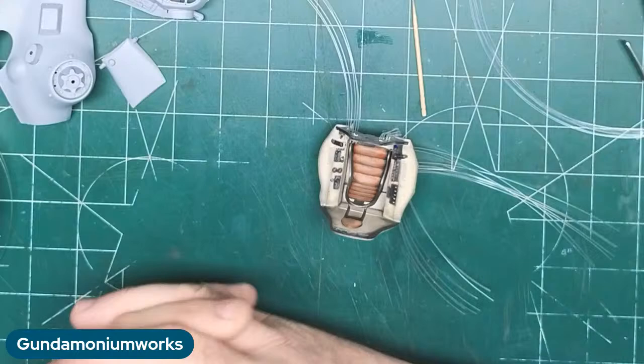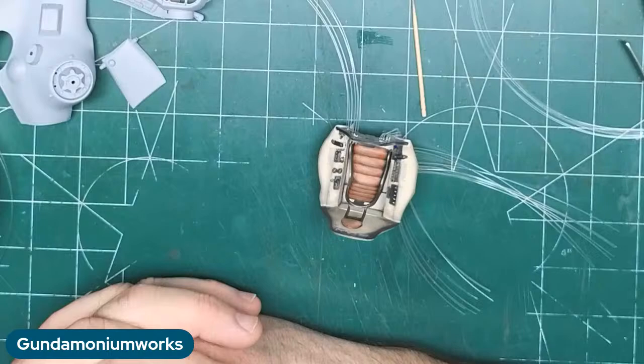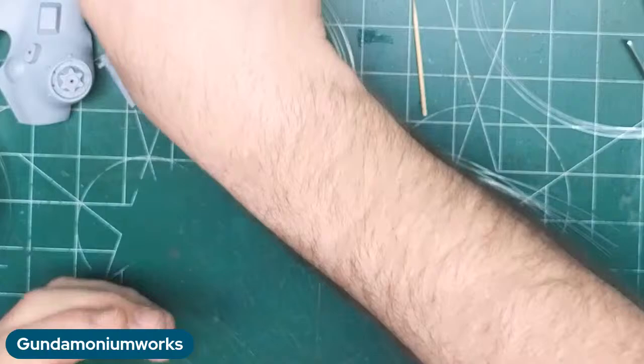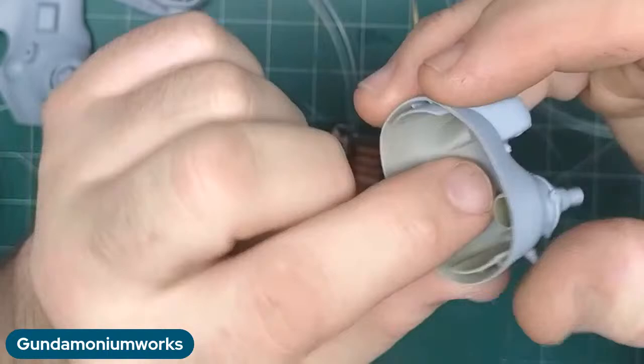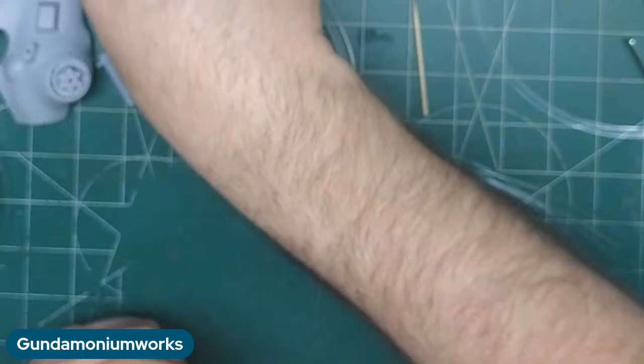But I think I've got some small amber, like 1.6 millimeter surface mounts that I could put behind that, and they're pretty bright. And that might work out, because I can run the wiring in through the top. There's a hole. You can kind of see that hole. It's like a little half moon shape. That's a hole through the top, which will come out through the back here. And I can run the wires up through there and just glue a small little surface mount LED facing forward.